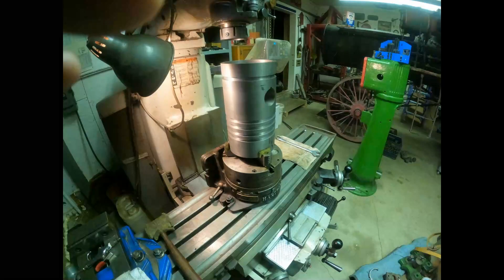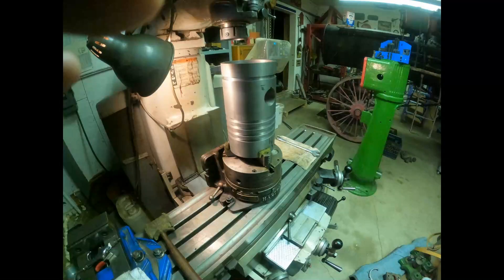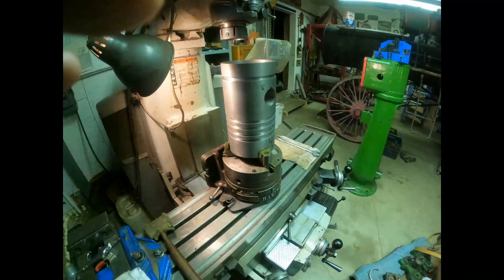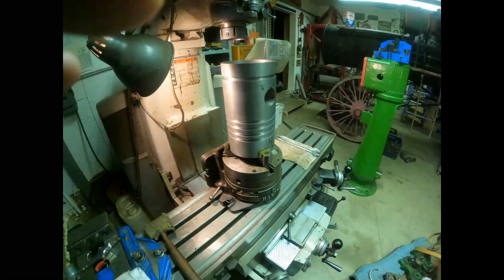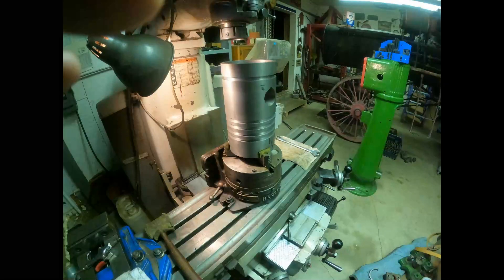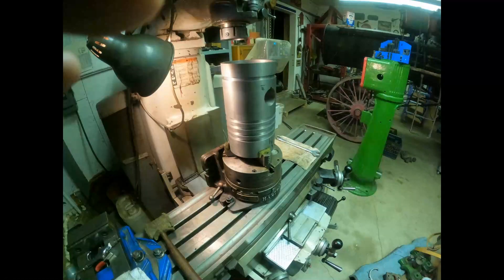That's all the time I got for this video. Here's a little look forward to the next video: I've got to reach in and dress the sides of these wrist pin bosses so that those bushings have a relatively smooth, square surface to mate up against. I've done a little bit of work on that prior to this video and it's proving to be quite a challenge to reach in there with a long enough tool without chatter. So I'm waiting on some tooling to come in and that will be in the next video. Thanks for watching — like and subscribe, it sure does help the channel out, and I really enjoy seeing the comments.